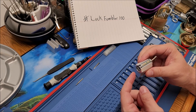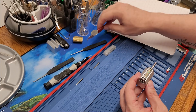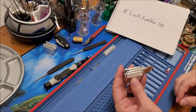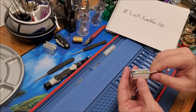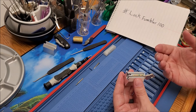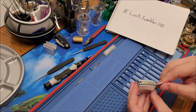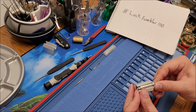Another thing that helped me out was getting one of these sets - you know, a lot of people have it - that comes with a little circlip remover and a couple different sizes of cylinder holders. When you put the pins in there and put your key in, you can turn it and make sure everything's working. That doesn't work if your pins are too short obviously, but if your pins are too long, they'd bind up and tell you that.